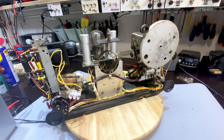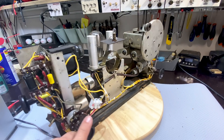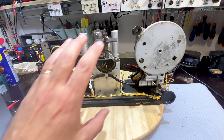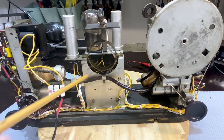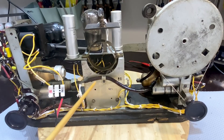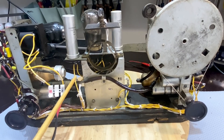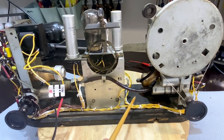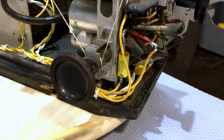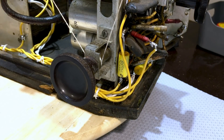This side, as you recall, I had completed. This needed some details. As you can see in here, there's no more of that old wire. I've completed the wiring to the other side of the supply - the B+ and there's a ground one as well. The heater wires I've done in white again. There's only one connection point on that side because there's only one tube, which makes it a lot easier.